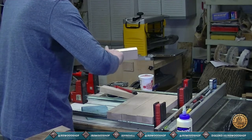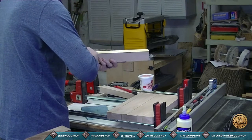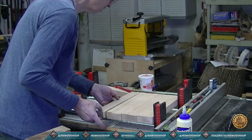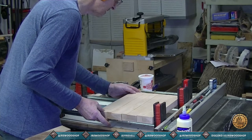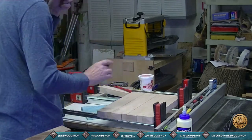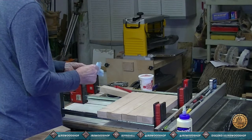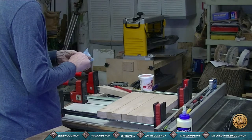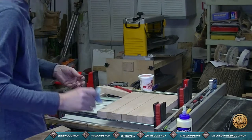I mean, I hope it does. My CNC is pretty accurate, but last time I did an inlay thing, it didn't work out as well as I wanted it to. And sometimes the secret is that your inlay doesn't need to be thick. I don't need to do a 2-inch inlay in here. The inlay portion only needs to be maybe 1/4 inch thick at most. It doesn't need to be very deep, because that wood is not going to be worn away over time.